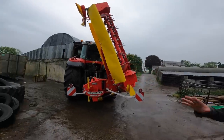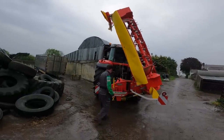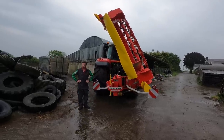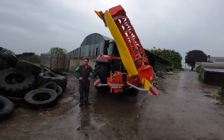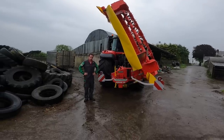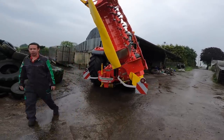The bed, conditioners, everything on this end is the same as the front. Your discs are the same, your blades are the same, conditioner tines — everything is the same, including your headstocks and belts. So if you have spare parts for your front mower, you have spare parts for your back mower. Both machines are compatible with the majority of spare parts.